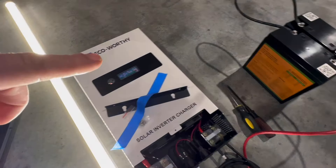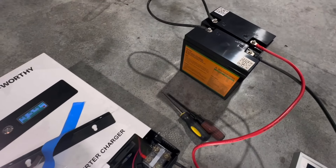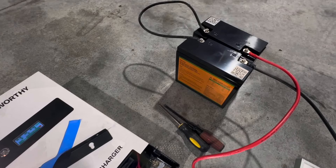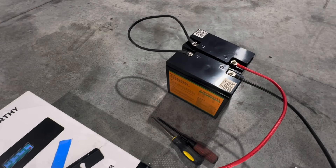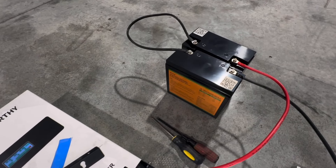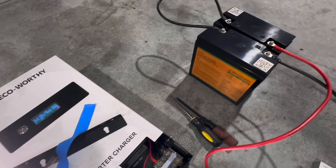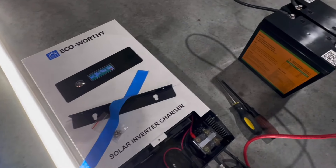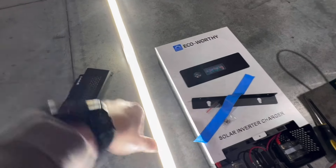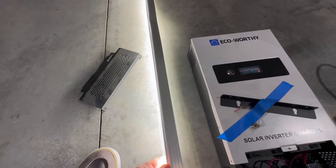This is the Amazon product — about $250. These batteries are around $100 each. The batteries are 30 amp-hours each at 12 volts, so that gives you 360 watt-hours, or 0.360 kilowatt-hours. There are two of them, so that's 0.720 kilowatt-hours of total power. You can run a 720-watt item for one hour off these batteries with no incoming power from the panel. With this system we're just looking to charge batteries and run lights.